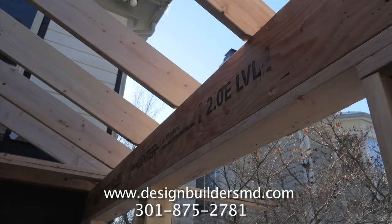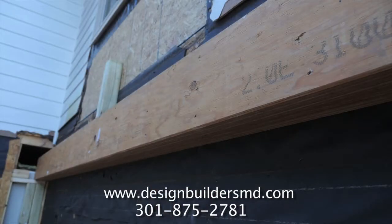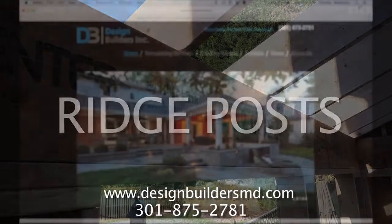Portal framing is used when there are large openings, as in a sunroom. With portal framing, an LVL, which is laminated veneer lumber, is built around the perimeter of the room and connected to columns with hardware.